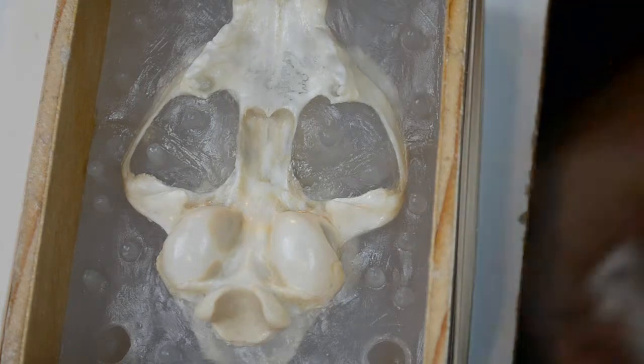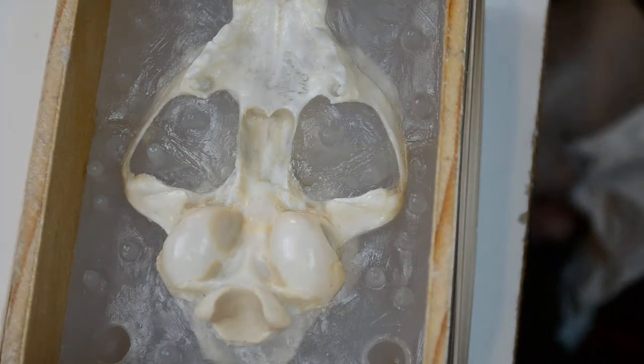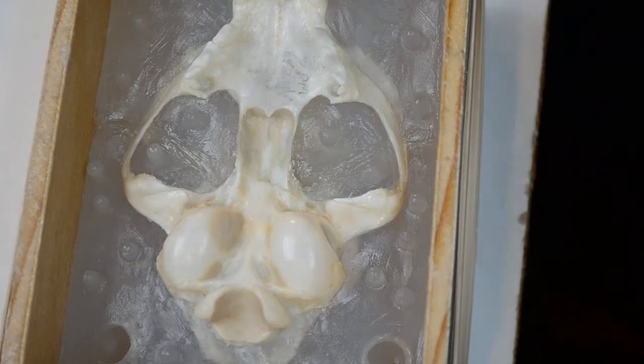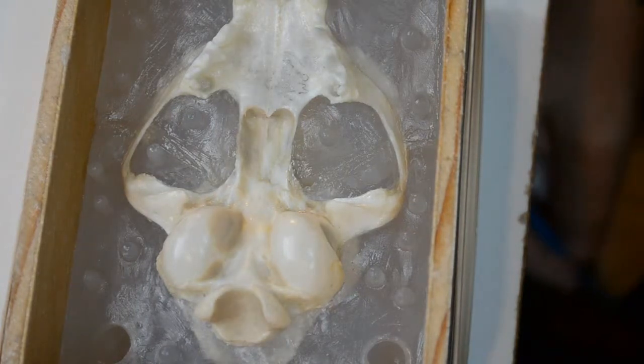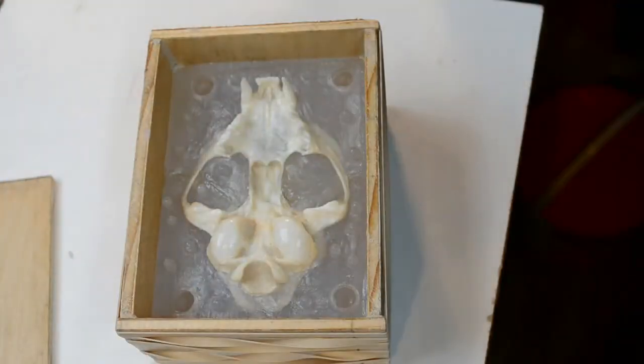The nice thing about the Vaseline is that as you go along, you can pick up even more of the little clay crumbs that you may find. So it works out really well. This is really clean and really set for molding. Here we go. Let's uncover the mold.